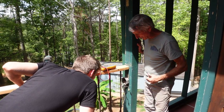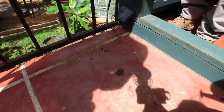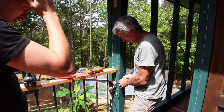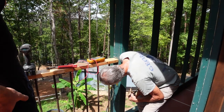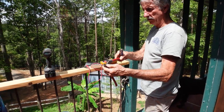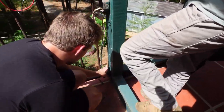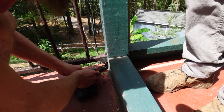Now we pull this box — that's not gonna happen easily. Looks like we need a 3/16 socket head — can you believe that? That's awful. These are cutters — they'll cut you pretty badly if you get your finger in there, but they're used for cutting wire. Cut as close down to the concrete as you can. We obviously cannot get into the concrete, so we're just going to have to live with that wire sitting above the concrete.